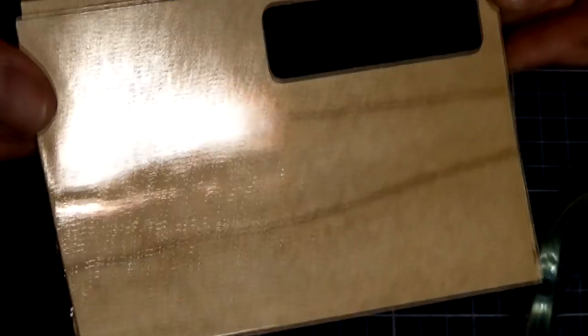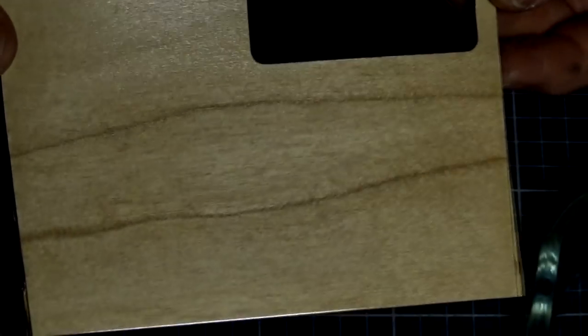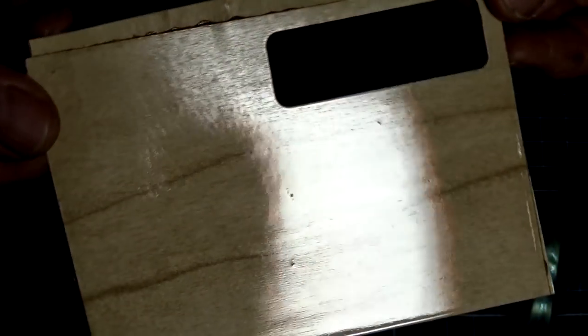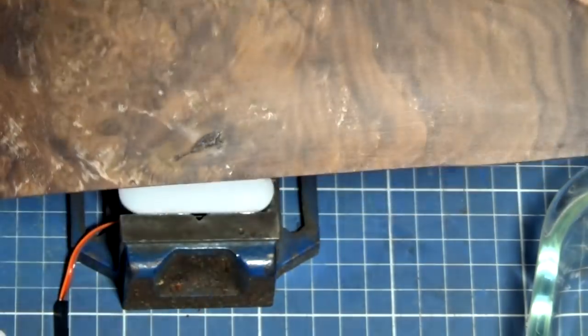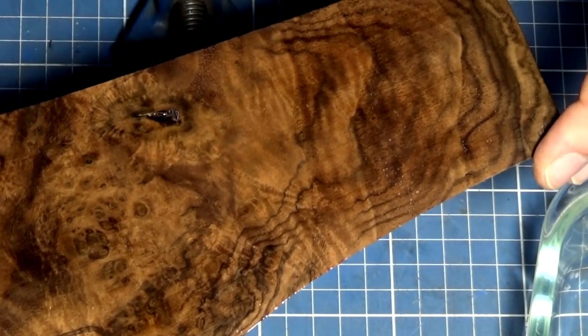So what I've decided to do is to use a piece of veneer that's already been bonded together. You can see that there. And I've already pre-finished this with a clear acrylic spray. And that's because once this is all assembled, I don't want to have to paint it later, because of that issue I mentioned about those very thin bridges. Now, I made this material here and I did a second one. This is some mahogany burl. I think it's mahogany anyway. Same deal though, it's two pieces of veneer. The front has been finished already and the texture on this is not quite as good. But when it's cut, it might be okay. We'll try them both, see how they get on.